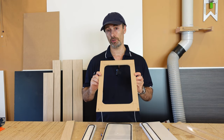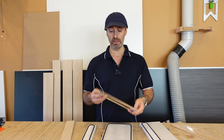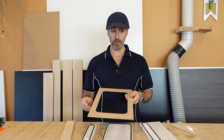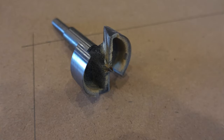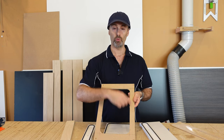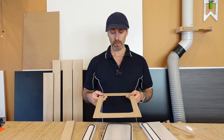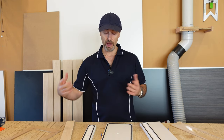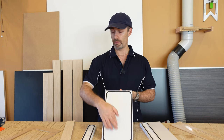It's using an actual template or a jig, which is just made out of 6mm or 1/4 inch MDF. I used a Forstner bit in the corners and did 4 holes to get that radius, and then cut out the middle with a jigsaw and then trimmed it on the router. So that was just another way of making it,